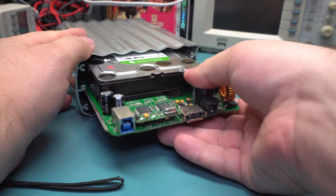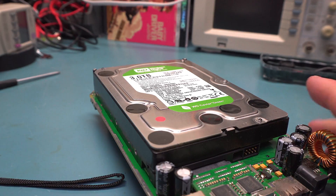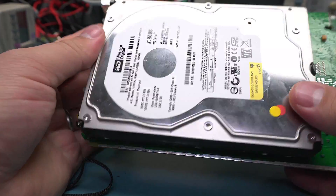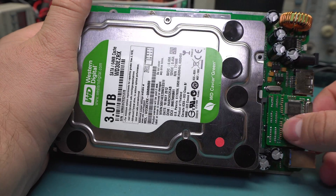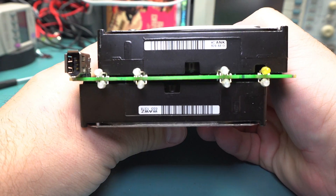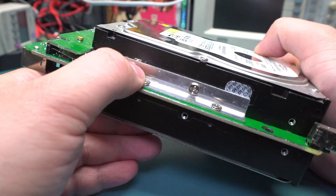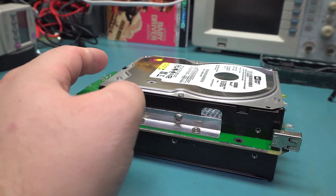If we remove the board — that is just an empty chassis. There's really nothing inside it; it's just the aluminum shell. I just stuck two broken hard drives in here so you get an idea of what it looks like. The drives that came with it are currently inside the NAS. It's a pretty simple layout — you've got the power supply stuff and a couple controllers. There's this mounting system which actually offsets the drives, using angled brackets which connect to the side mounting screws on one drive and the bottom mounting screws on the other. It's reversed on the other one — a clever idea to mount two drives in a pretty compact area.